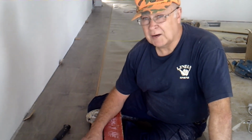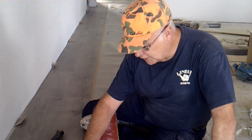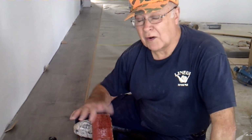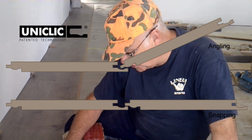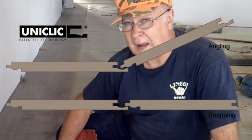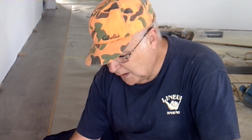If I can, when I'm buying laminate floorboards, I pay careful attention to the grooves and try and lock a couple together if I'm able to see how good the fit is. But if you examine the edges carefully, the tongues and grooves, you can see how well they are going to lock together or not lock together. And the difference between good floorboards and cheap nasty ones to stay away from are the quality of the locking edges.